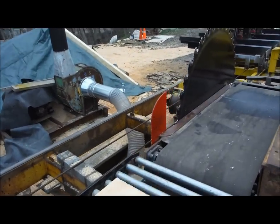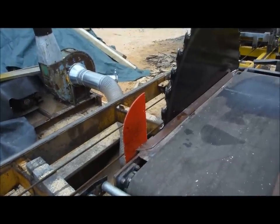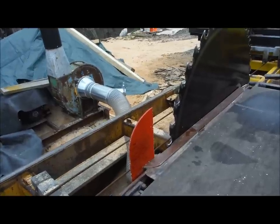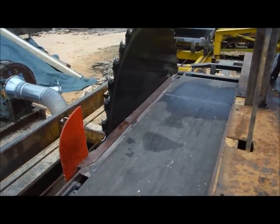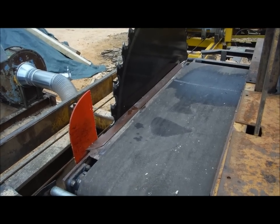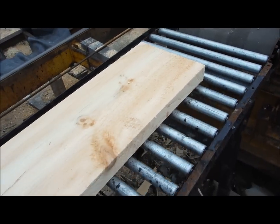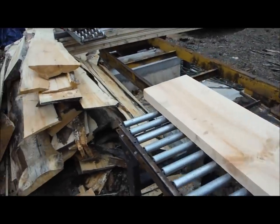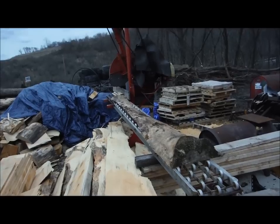This is the off-bearer side of the sawmill, and the backside of the saw blade. This is the board splitter, which keeps the log cant face in the board from binding. There's a live belt that comes off of the mandrel which feeds the boards onto the roller table.